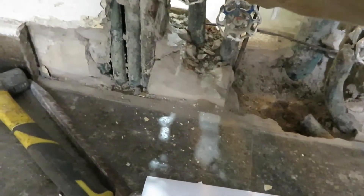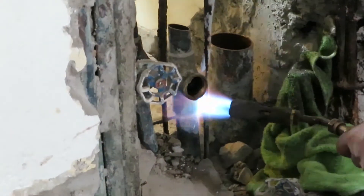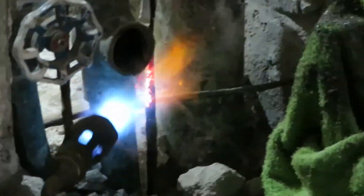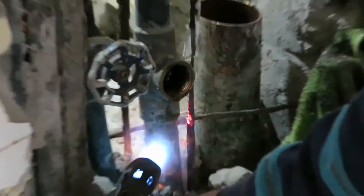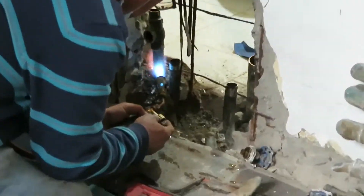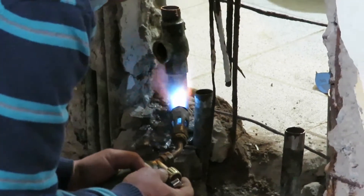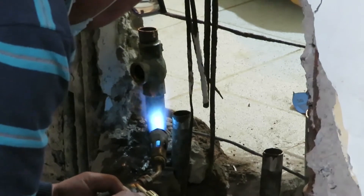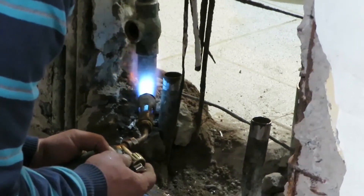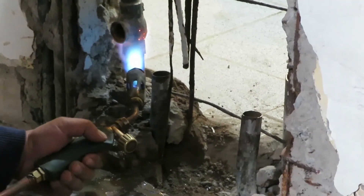Also, it's not easy to blow the water out with that length of pipe — you would have to be a super blower to get it all out. Other plumbers have other methods to solve this problem. They heat the pipe and the valve enough to boil the water, make it bubble out and evaporate till the solder melts, and the valve can be moved and removed. I have done this. It has worked. But it can be a slow process before one is able to get the valve off.